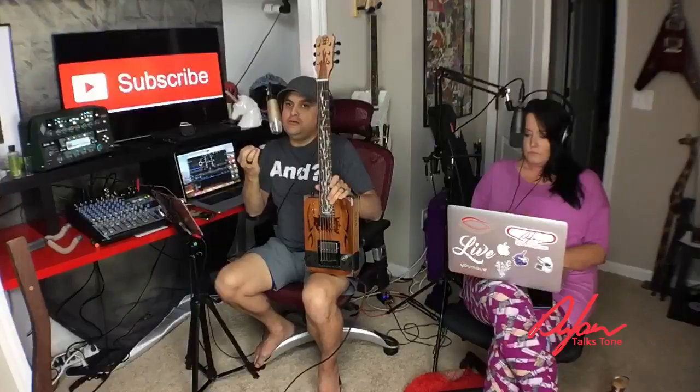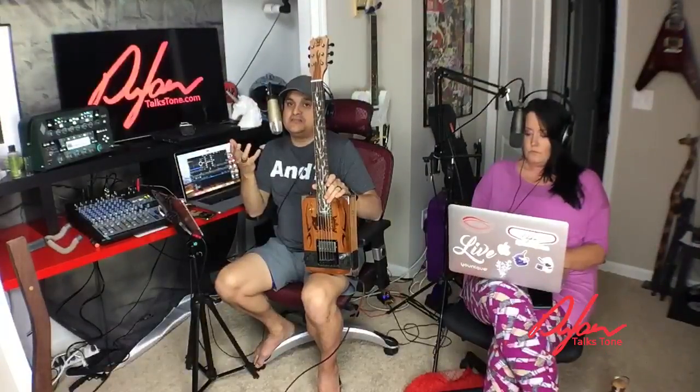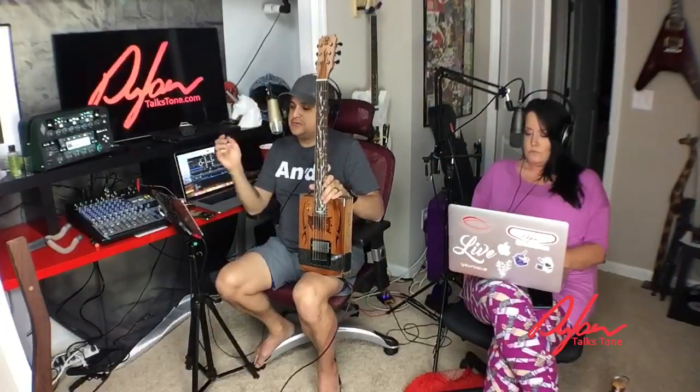So, a lot of people like to go series parallel instead of coil splitting because you get that clarity of the single coil without the hum because it's still hum canceling. So, it's super, super cool.